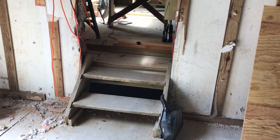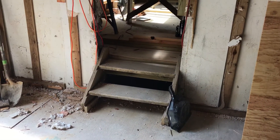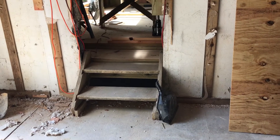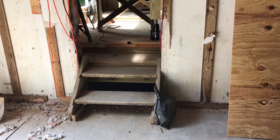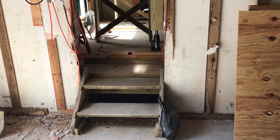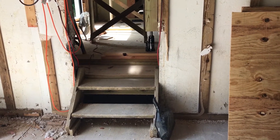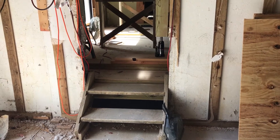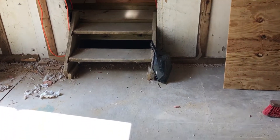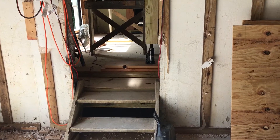Good morning, we're just about to start phase two of raising the house. As you'll recall, we are bringing the floors and the roofs of this house up 16 inches and we're doing it in two stages. We've got block walls in the old section, so we can actually raise the floors up inside the house on top of piers rather than having to lift the whole house. We've done that in the old section. We've got new floors installed 16 inches higher than they were, and as you can see, this section is about 16 inches lower than that section because that one has the new raised floors.